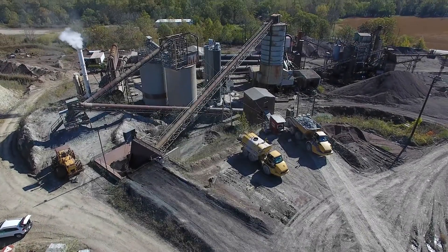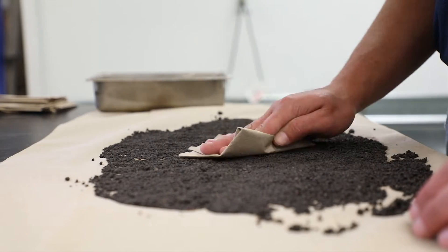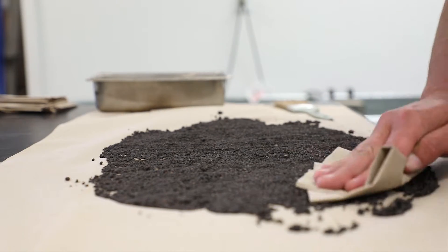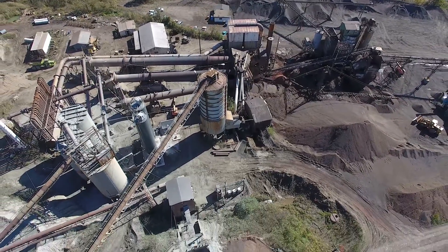Hi, I'm Mitch and I'm back today to show you how to perform the ESCS towel dry test on pre-wetted expanded shale, clay, or slate fine lightweight aggregate, which is known as ESCS aggregate. The towel dry test is used to determine the amount of free water or surface moisture on the aggregate used in the concrete mix.